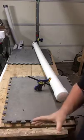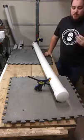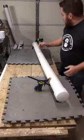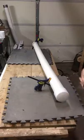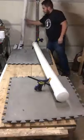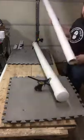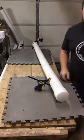This is for when I have to do steam bending a couple times or a piece on a thing, and I need something that doesn't cost an arm and a leg to do that. So this was my contraption that I rigged up for that. It is a piece of PVC pipe, and it's got a cap, and it's got some fittings down here. The thing about PVC is when it gets hot, it will bend. It won't take these high temperatures for a long time or repeatedly. I used one for two weekends pretty heavily, and I don't know if you can see it, it bowed pretty good because it was not supported well, but it'll warp it. So like I said, this is not a high volume, high production kind of steam bending kit. This is for small little bits that you have to do.